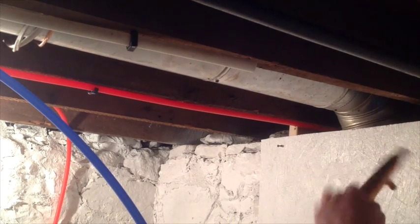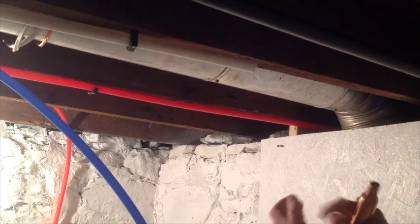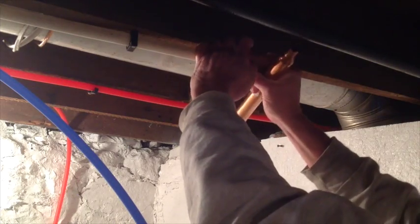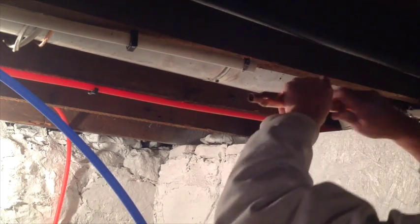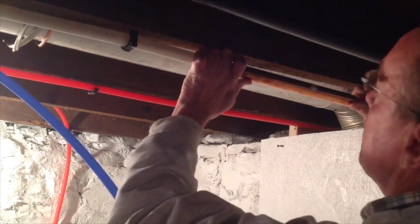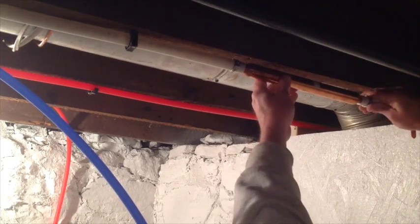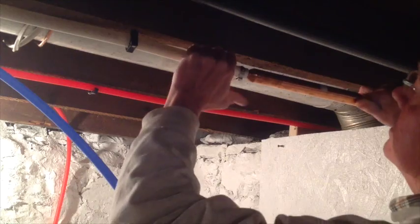Got the manifold. Got two clamps — slide your clamps on. Anyone who's comfortable working with PEX knows how this all works. The manifold goes back in on both sides. I've got some flex here as I mentioned earlier. It goes in on both sides, and you can see it. We're going to line it up and crimp these two fittings, and we are good to go.